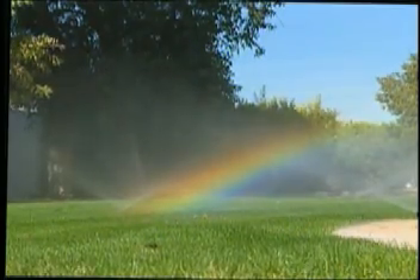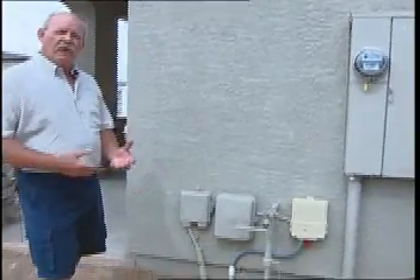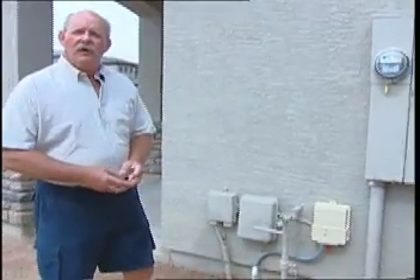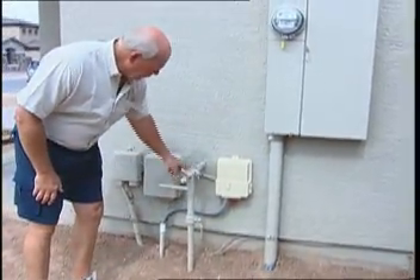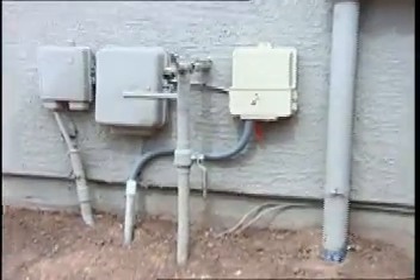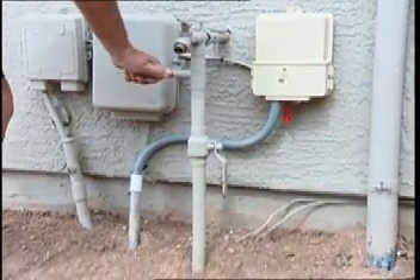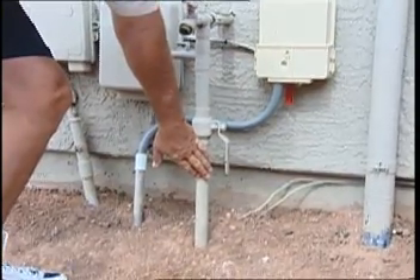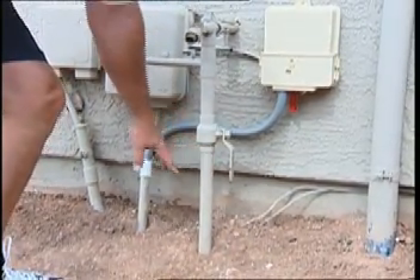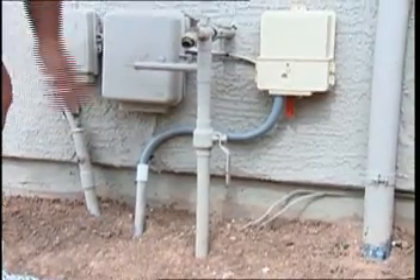What we need to do is assess the yard to design our sprinkler system. One of the things we need to know is where the water comes into the home. The water from the water meter comes through the pipe and enters the home right here. This is the line we need to tap into. We have a three-quarter inch line coming off, put in by the plumber, but we want more water, so we're going to tap into the one-inch line below the valve so you can shut your house off without shutting your landscaping off.